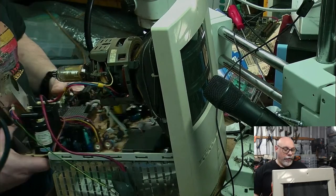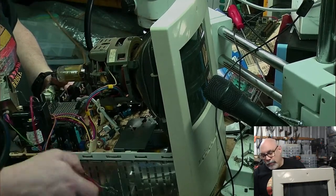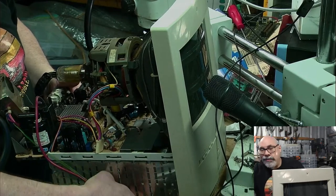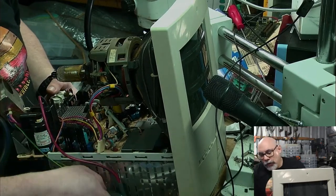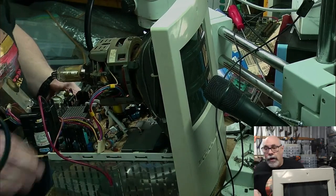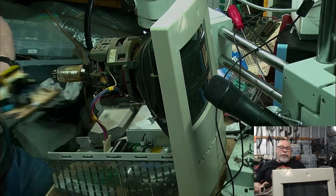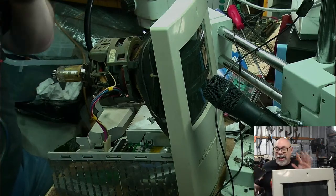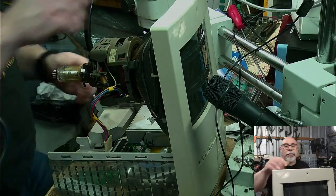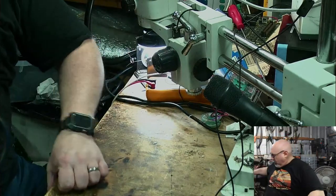Okay. So sliding out an analog board here, they come out nice and easily. It's a very easy process if it's done correctly. And the only reason why I say that is because someone sent me a Color Classic once to work on, and it was clear that someone had tried to remove the analog board via, I don't know what they did, to be honest. But they had just bent metal left, right, and center, and I had an absolute nightmare getting it out. It's a job that should take a couple of seconds, and it took me probably about an hour to get it out. And it was really frustrating because it was only because someone had stuffed it up.